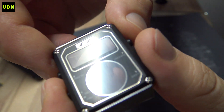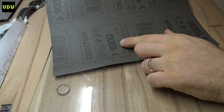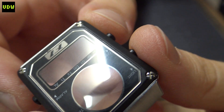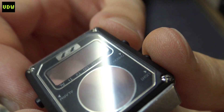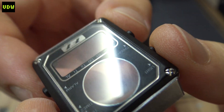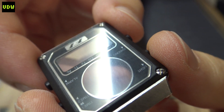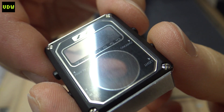With loads of elbow grease, we've removed all the scratches. All you have to do now is resurface to a smaller grit. That is the finish we're looking for — without scratches. The 1000 grit left a matte finish, which will be removed by the Cerium Oxide slurry. I'm not going to explain how Cerium Oxide works since you've seen it in my other videos — pretty close to finishing and pretty pleased with the result so far.